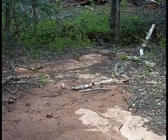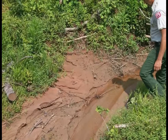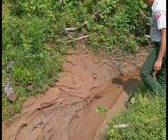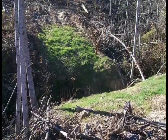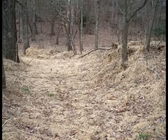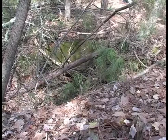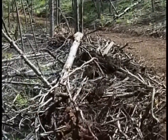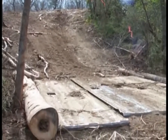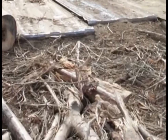Avoid digging up or pushing out large stumps. This will create a hole lined with unstable soil, which can easily wash away into the stream and pollute the water, even long after the logging job is finished. Any bare dirt area that threatens to pollute the stream will need to be stabilized and reseeded, as described under Section 9 of the North Carolina FPGs. Extensive site rehabilitation can erase profits from a logging operation. Any brush, slash, laps, or tree debris that have to be removed for the bridge mats should be placed near the approach corners of the bridge location to help act as a filter barrier to prevent any dirt or tree limbs from being dragged into the stream channel.